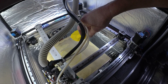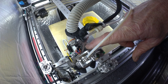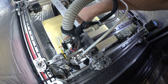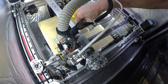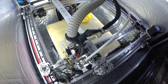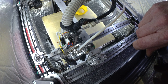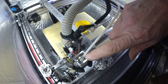I need to get a bigger motor — this one is too small. I've tried so many different things to get the flow higher for a 0.8 nozzle, and it really boils down to the speed of the filament: the motor just doesn't have enough torque to push it at that speed. You can see this wheel is just whipping around.